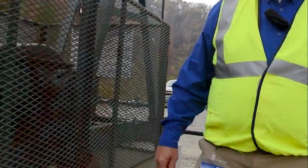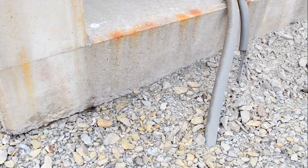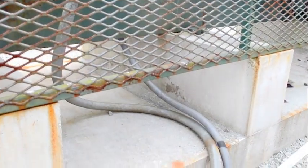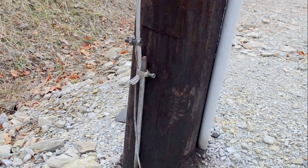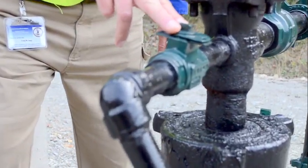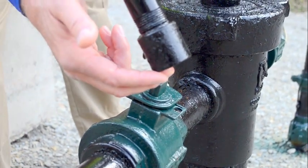The next item that we check for are electrical grounds. The grounds will be on the electrical motor that runs the pumping unit and also on the electrical motor starter. Our next item is to make sure that the valves have their handles removed or plugs in the end.